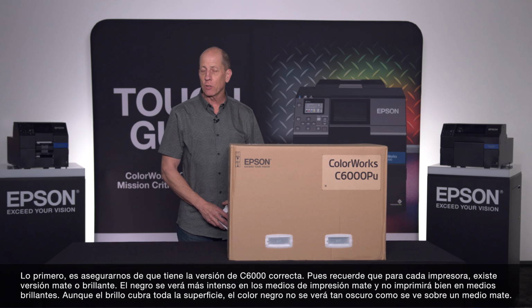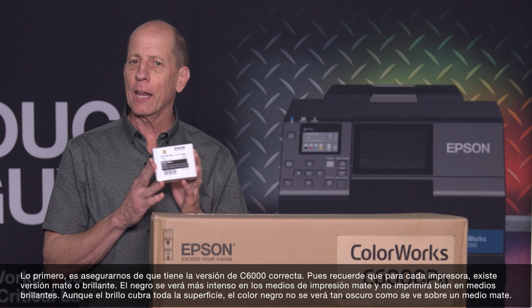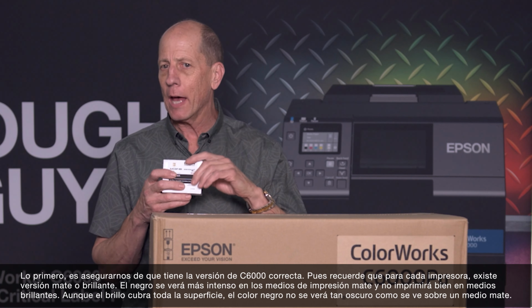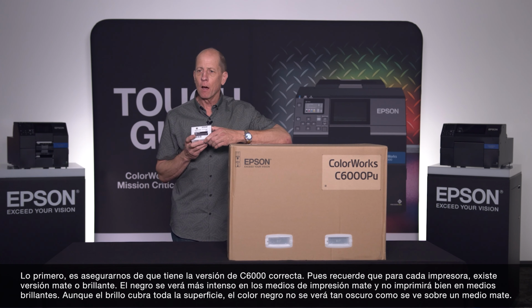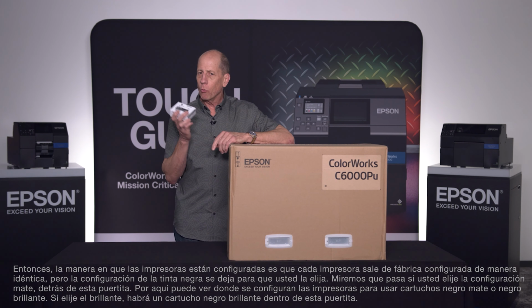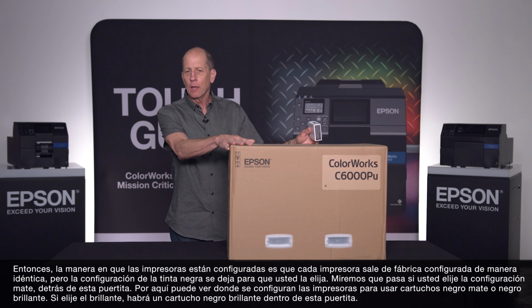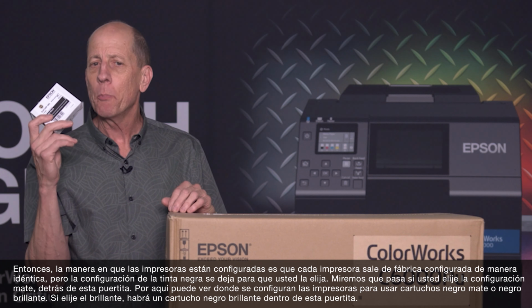The first thing is to make sure that we got the right C6000, and remember that for each one we have matte and gloss. The matte media models will look blacker on matte, but cannot really print well on gloss. The gloss will print on everything, but doesn't look as dark black on matte. Every printer ships and is configured identically, but the black is left off until you pick which one you want.